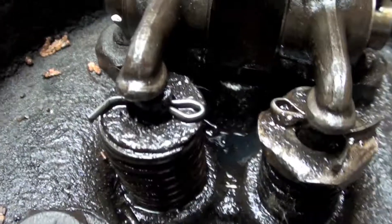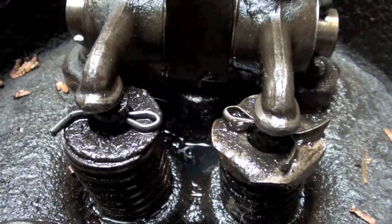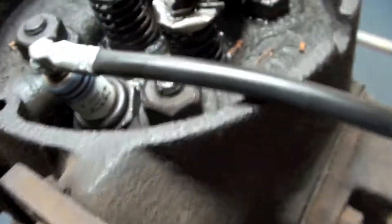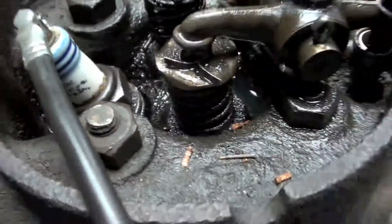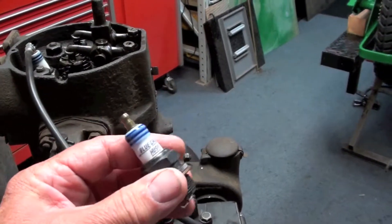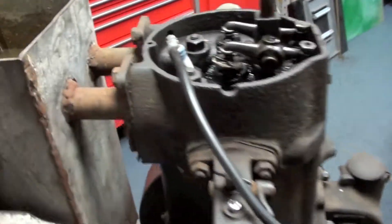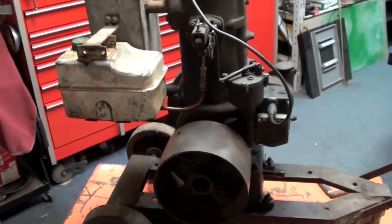This is a no-no but it's temporary - the exhaust valve pin was just about to drop, rotted off, so temporarily I put cotters on there. It's also got an old Blue Crown plug in it, and I looked through my inventory and just happened to find a brand new one, so we're going to put it on - this one's fouled. We'll continue when we have more information.